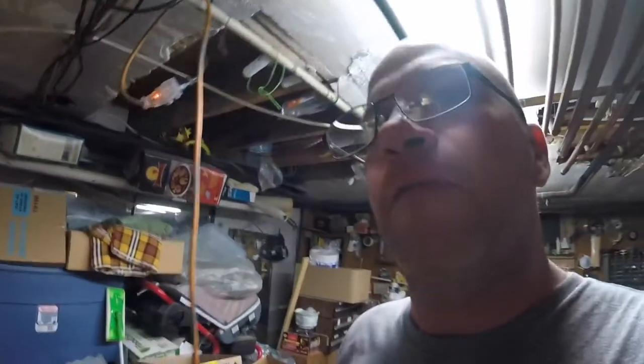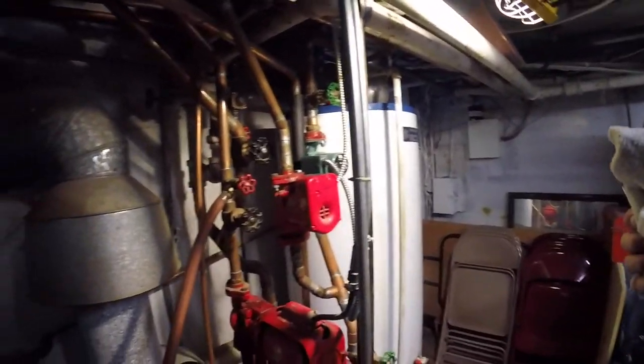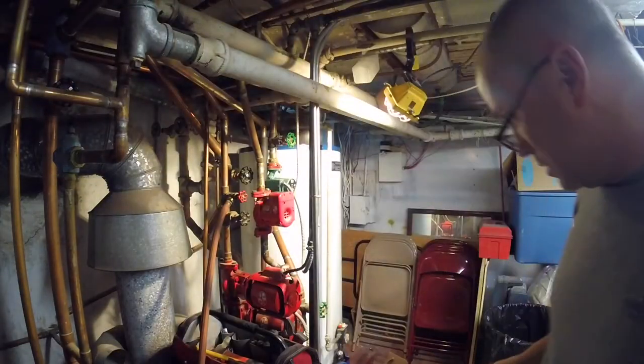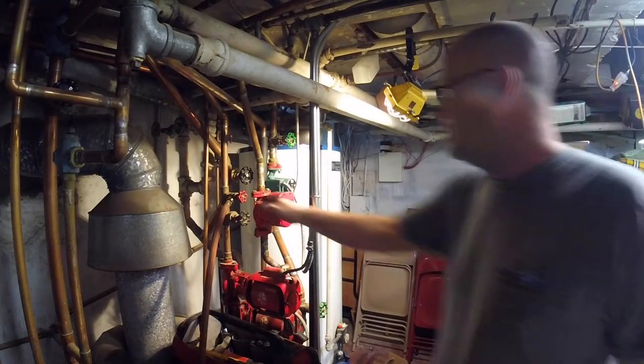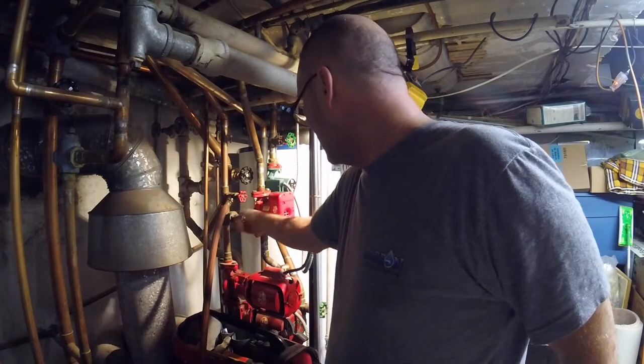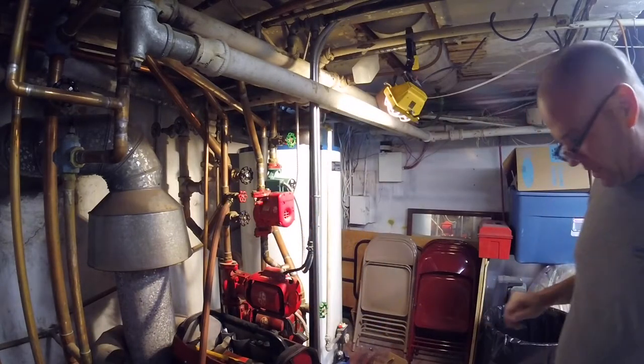Okay. I just bled all the radiators. They're all pretty good. And I'm still purging this loop, which is good. I couldn't film because the gentleman was with me, and, you know, I don't film with the customer around. And she's still purging out. So we're going to turn the heat on and see how we make out. Fire in the hole. Here we go, everybody. All packing nuts are tight.